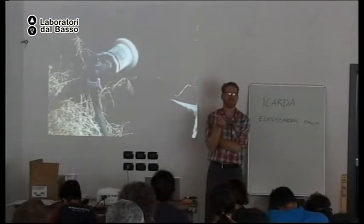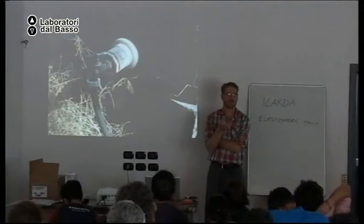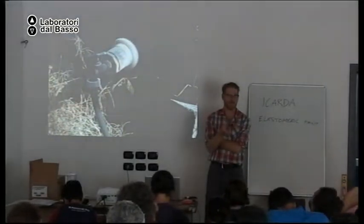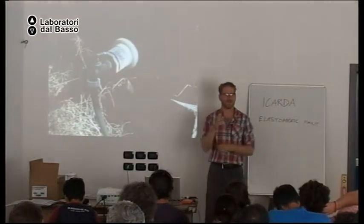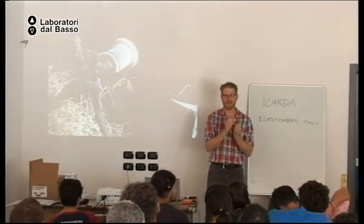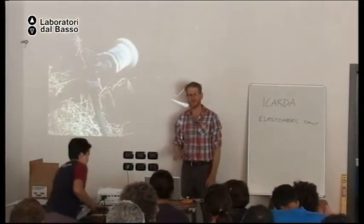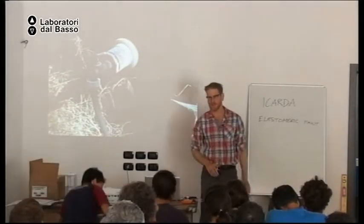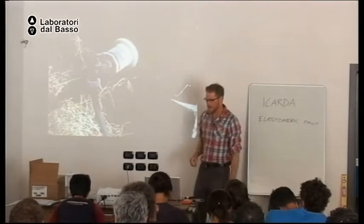So what I heard from an Australian company that sells lead-free PVC is they told me that in some factories that make PVC pipe, they use lead as the lubricant or the material between the form that makes the pipe and the plastic. So some lead gets into the pipe. If it's written lead free, you're okay.